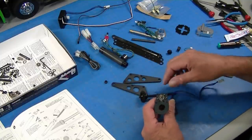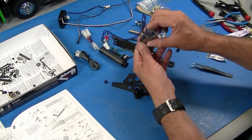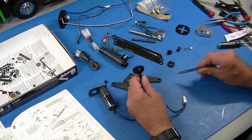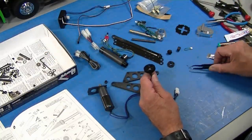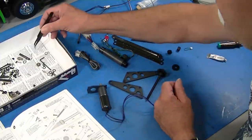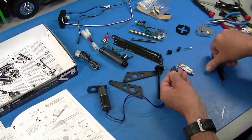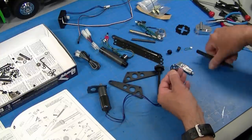There are the parts for the actuator kit. I mounted the motor on the plate. There's a little addendum in the instructions that tells you to make sure you get the motor in position with the wires across from each other. Then I mounted this little gear on the shaft — it mounts with a little c-clip wire clip, which gives a new meaning to the phrase 'oh my word.' Anyway I got that in there. There's a shaft that fits here and this drops over it with these little balls mounted in these positions, which give it a clutch effect. I use a drop of grease to stick the little ball on there, which holds it in place while I put the assembly together.